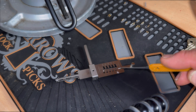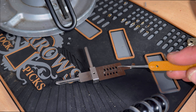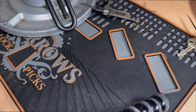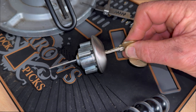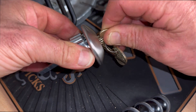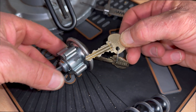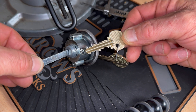The creation of this tool by Jason Hillier has created a huge amount of interest in the Ingersoll cylinder and it's had a lot of people pick something that they haven't been able to pick for quite a long time, or if ever. Here is one of the modern renditions of the Ingersoll cylinder. When we pop the key in, you can see that the tailpiece rotates with the key, and when we get the key out it comes out in one position. Have you wondered what exactly is happening inside here? It's referred to as a lever lock — in fact there are ten levers — have you wondered what actually goes on inside when you put the key in?